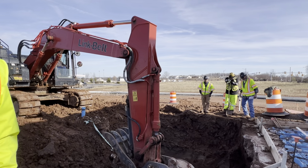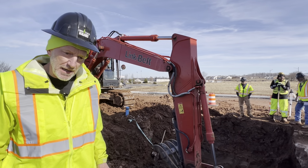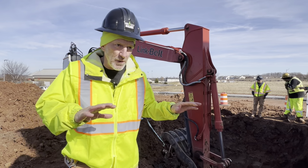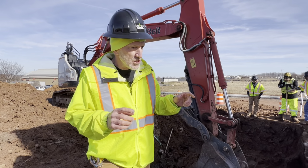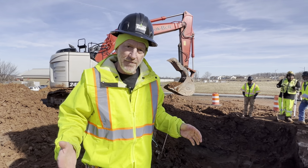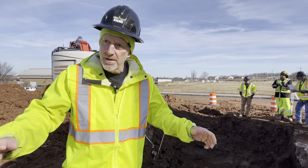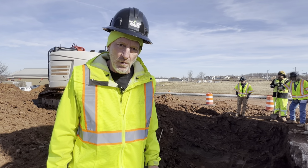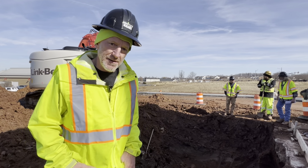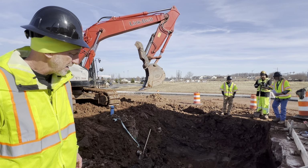Inside the building right now, we're getting ready to rough in our trades, mechanical, electrical, plumbing, and do all that quickly to get the site stabilized generally. So now I can get bricklayers here, and you get the underground done first, and then we can bring in scaffold and bricklayers, and they're going to be able to work for a month, probably in cold, snow, whatever. If that's the case, then we'll have to tent the scaffold. That's generally what's happening here at the moment.